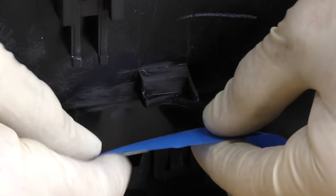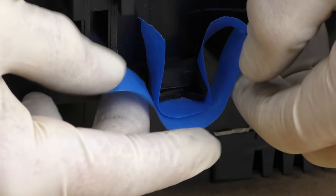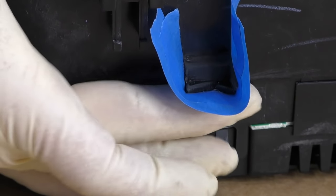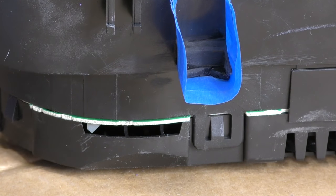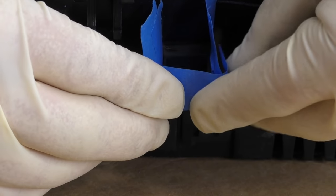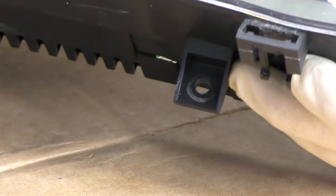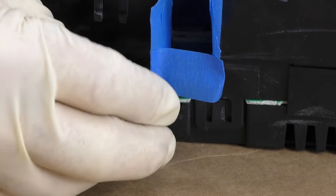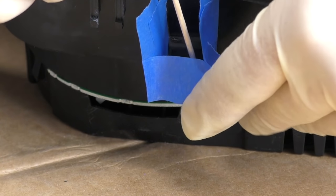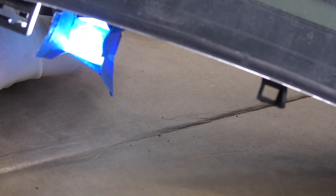Next, we're going to take some masking tape and build out a new tab — go up underneath and around, and do that one more time. We're basically making a channel that mimics the size of our other tab. It doesn't have to be perfect; we can always come back and sand it down and trim it when we're done. The final piece is like building a little dam at the end so the epoxy doesn't flow over and out of our taped area. If you want it exact, measure it out and see how far you need to go. I like to eyeball it and overshoot just a little bit so I have room to trim. We can also take a pick and fine-tune the shape. From the outside, you can see the plastic where it broke, and this whole area in here is going to be filled with epoxy.